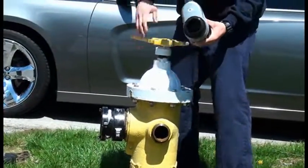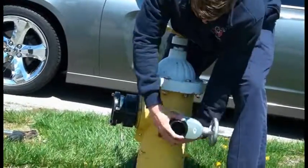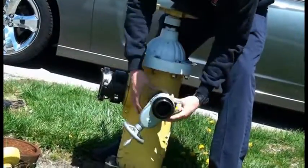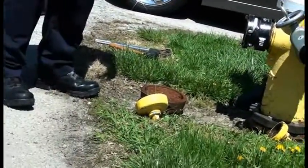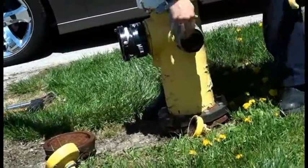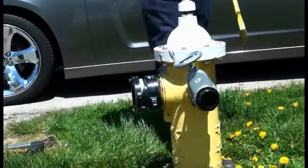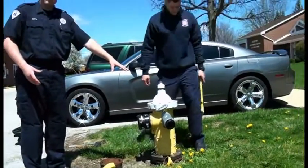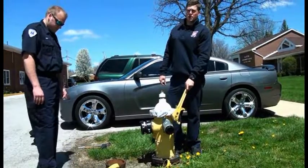John's going to put the two and a half inch gate valve on there. To properly maximize a hydrant, you should put the gate valve on the side of it. If you need to use it and you were filling a fire engine up with water, you'd have to shut the hydrant completely down to put this gate valve back on it. So this way, now it's on there — that's the proper way to do it. That way, if the water's coming out, you don't have to shut down the hydrant to put the gate valve back on. You want to keep that in a closed position initially.